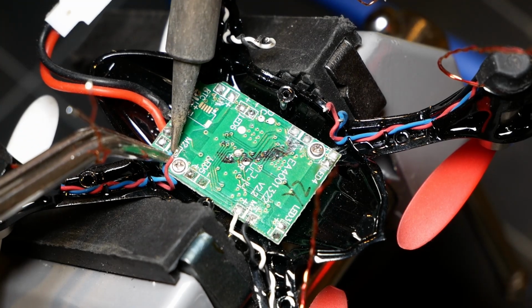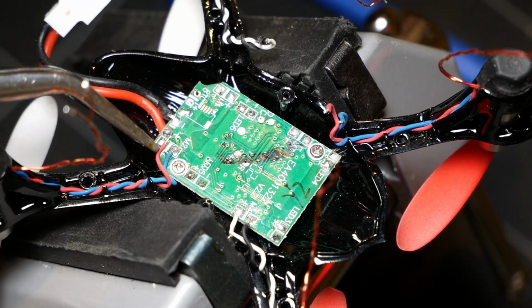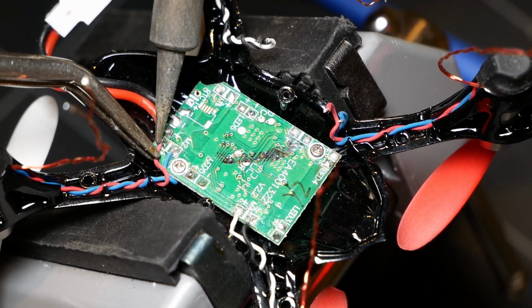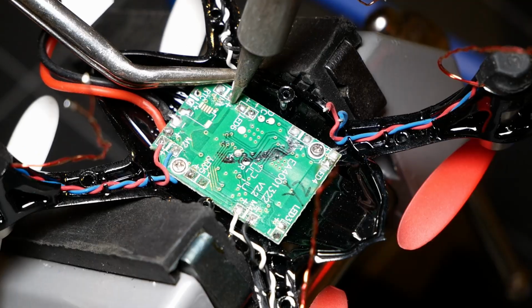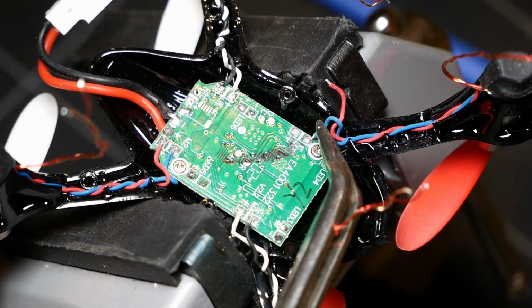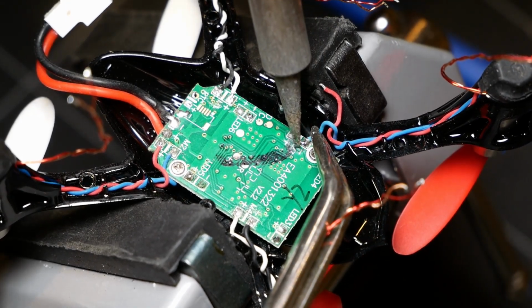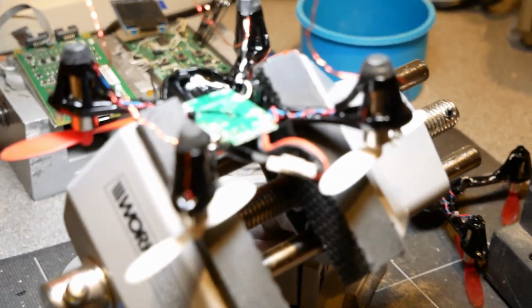Soldering up the motors and arm LEDs is a slightly fiddly job, not made much easier by the camera and lights in my way. The motors are directional, presumably down to the direction that the brushes sit on the stator, so they've colour-coded the wires to make sure you can identify them. Well, that's the motors wired up, just the LEDs to go.